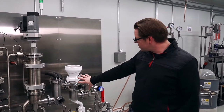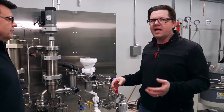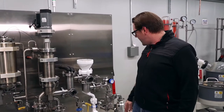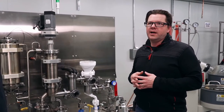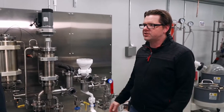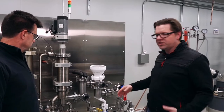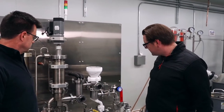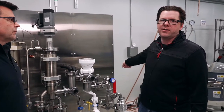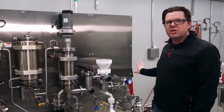A lot of people wonder about 'flow' in this context — it's not really flow rate, it's actually diffusion. As the vacuum goes lower and lower, diffusion is less hampered by other gas molecules, so migration or transport from the evaporative surface to the cold finger actually improves. That's why you want the condensing cold fingers there — to capture everything that's in the vacuum, because you definitely don't want that material going into the pump.